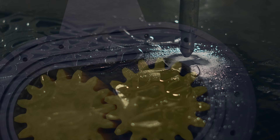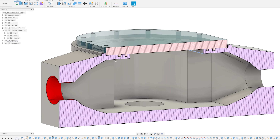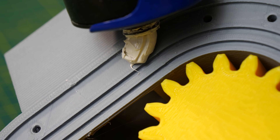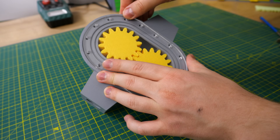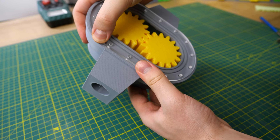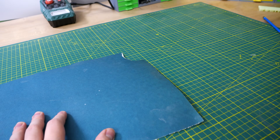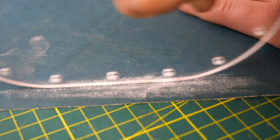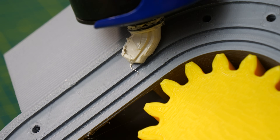The housing has 2 negative extrusions, and the 3D printable lid has 2 positive extrusions to help with sealing and a tighter fit, but my acrylic lid doesn't have those so I'm going to use silicone to make it watertight. I also had another 0.1mm error — the fit was so tight the lid wouldn't fit. So instead of printing a whole new housing, I just sanded it down 0.1mm. Now the lid fits on the housing perfectly.